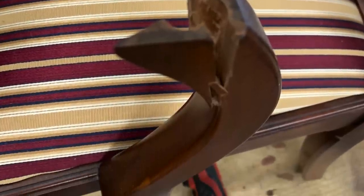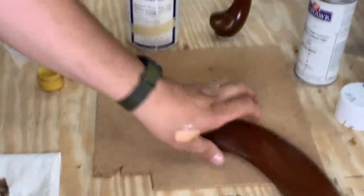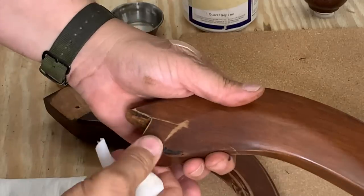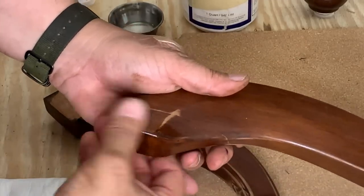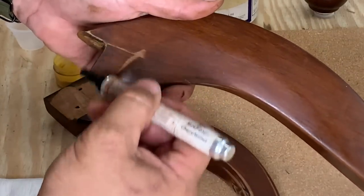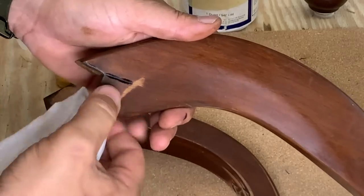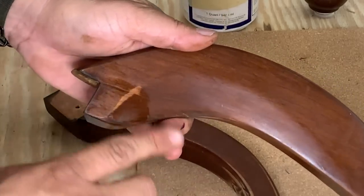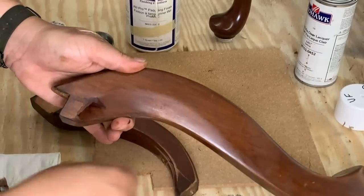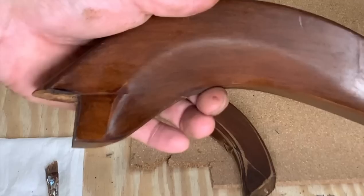I've got a broken arm here for this chair, but now I've got all these places where the color's missing where I sanded the joinery smooth. So you could, if you're in a hurry, use a touch-up pen and go along — it's going to be a little too dark and a little too red. Take anything and lighten it up a little bit, and that doesn't look too bad. Go along the edges with it. Primarily I use touch-up pens for these areas, but what you end up getting is pretty close, but not quite what you wanted. Most people just scribble it on. This is just a painter's light that keeps my fingers wet and helps me move that color around a little bit. So if you have a touch-up pen that's pretty close, that's one way to do it.